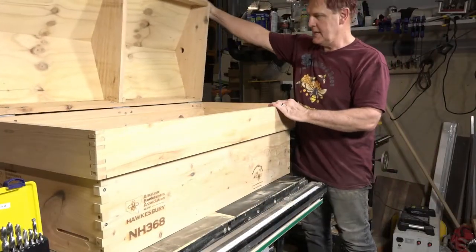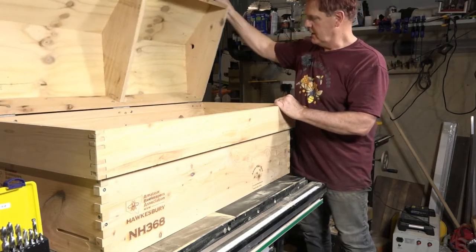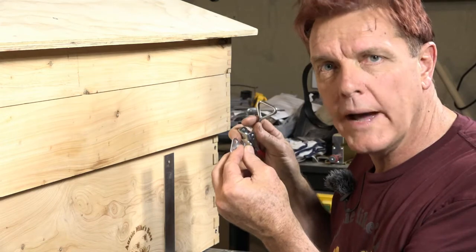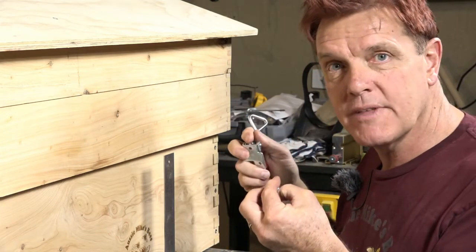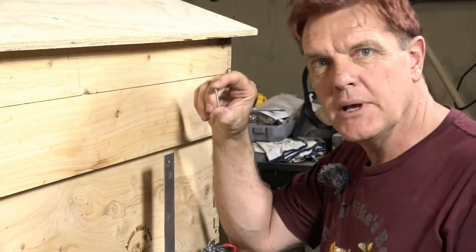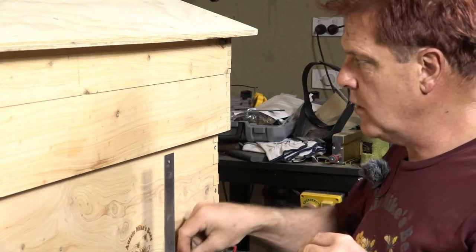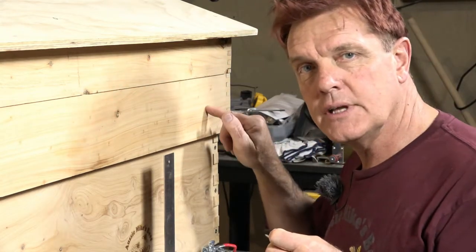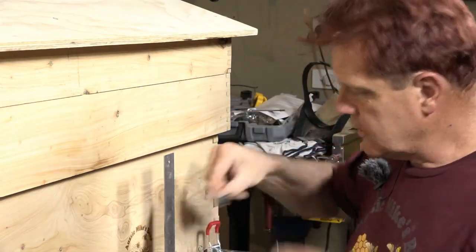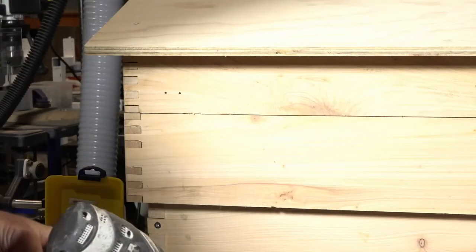Opening up from this side. I like that. Now, unlike the hinges, the catches don't bear any real weight. So I don't need to have those bolts with the nuts. I'm just going to use screws, and I've decided to use these 32mm or 1¼, 10 gauge. They fit through the holes nicely. Why I chose that, I don't want any hardware to go through to the shelf on the inside. These parts of the brackets have 3 mounting holes, and the hook that'll mount up to the top here has 2. That'll be plenty.